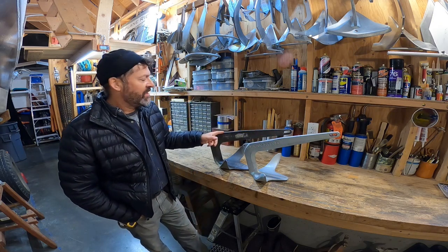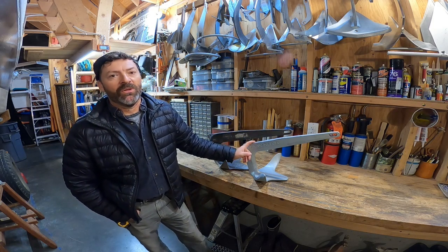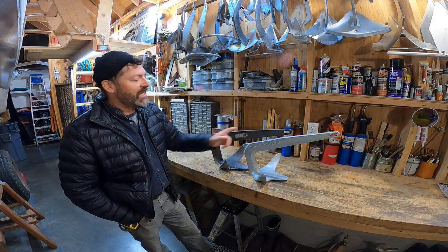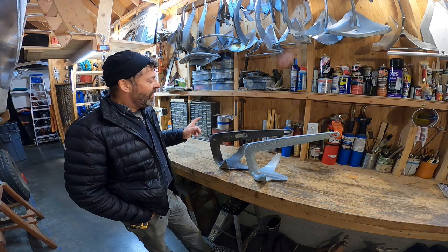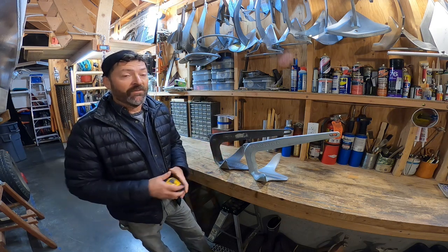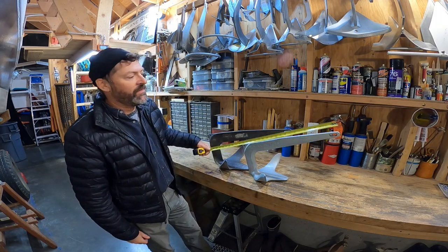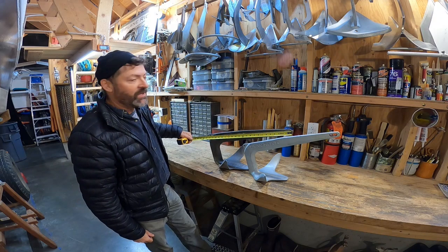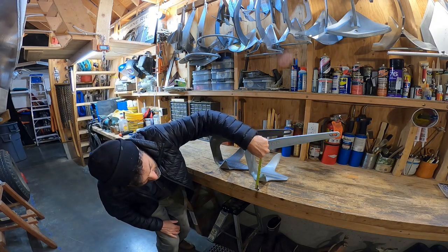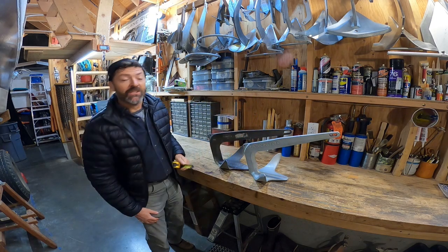Now the Bruce anchor did come out at 21 pounds on my scale, where the claw came out at a solid 23 pounds once it read 24. So it's a good 2 or 3 pounds heavier, but the claw is dimensionally smaller than the Bruce in nearly every way. For example, the length of the shank is 21.5 on the claw, while it is 23 for the Bruce. The height of these fluke tips are 4 3/4 for the claw and 5 3/8 for the Bruce.